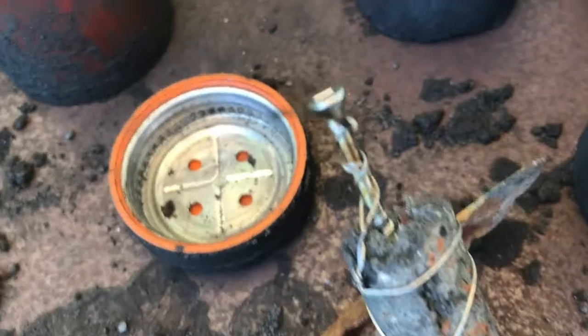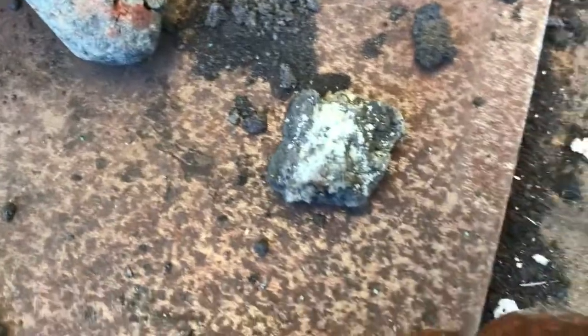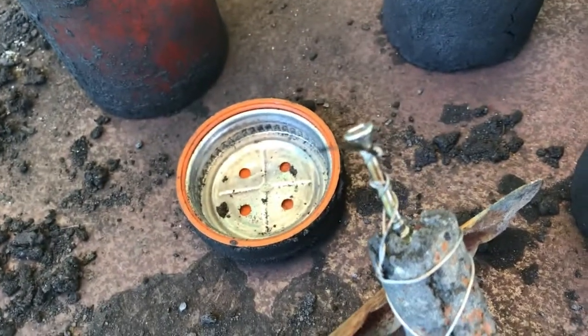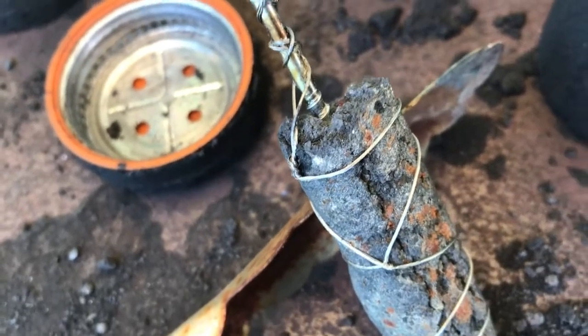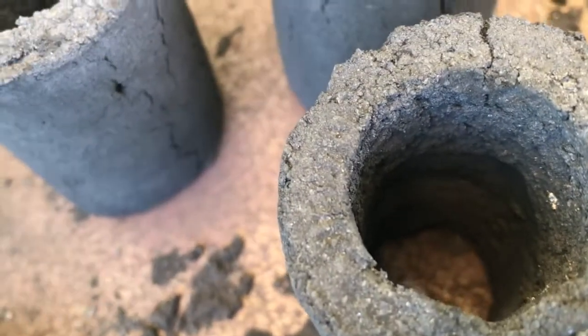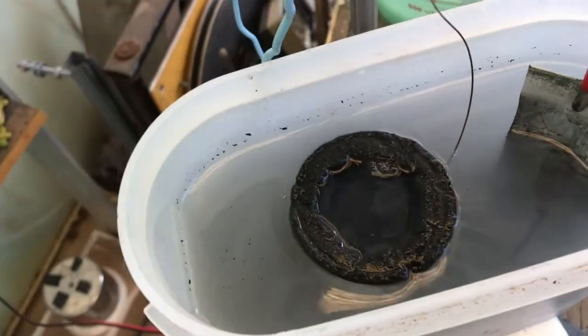Okay, it was all going fine and I thought I'd try to wrap that wire around the top of that and solder it, but no good. And I broke that much off. So don't play with them too much because they're fragile. Now I've got 6 ohms from the top of that down to the bottom of the carbon, which is acceptable. That thread's a bit loose in that hole for some reason. It's the same drill I used in the other cell, but this stuff's a bit more porous and flakier. So have to relook at doing those center electrodes. Depends on how well this test turns out, which style we go for.